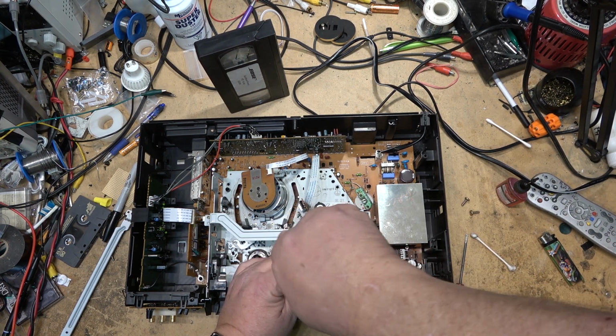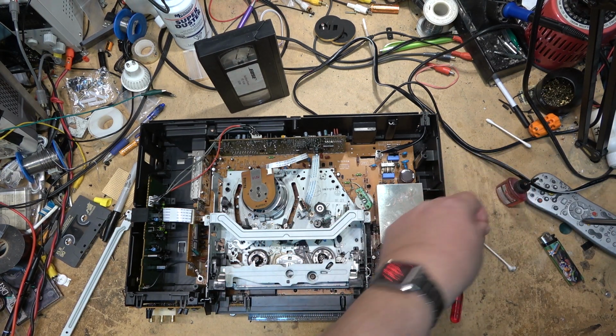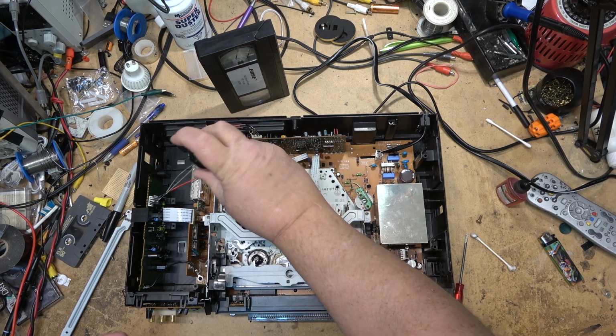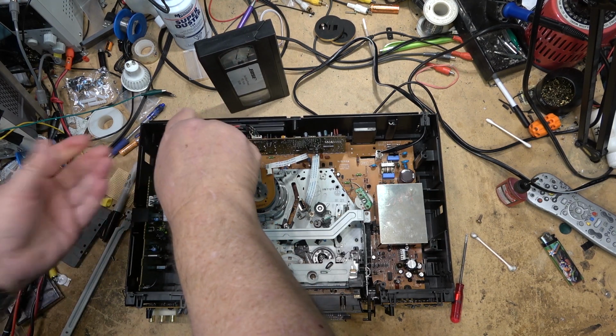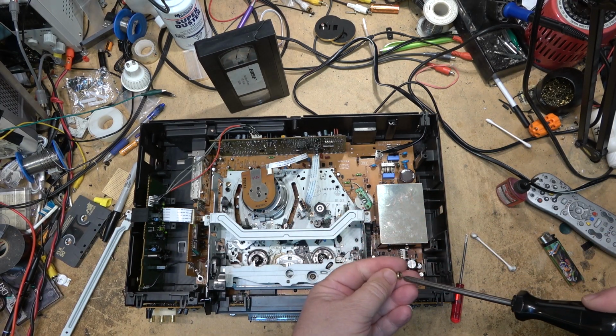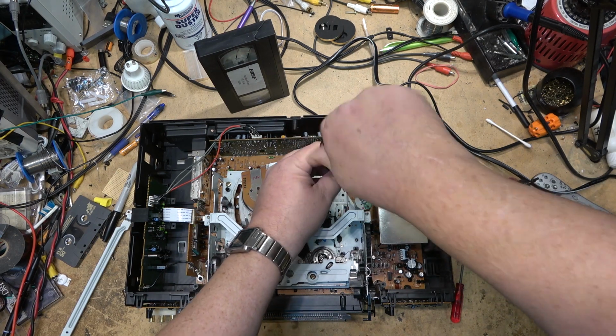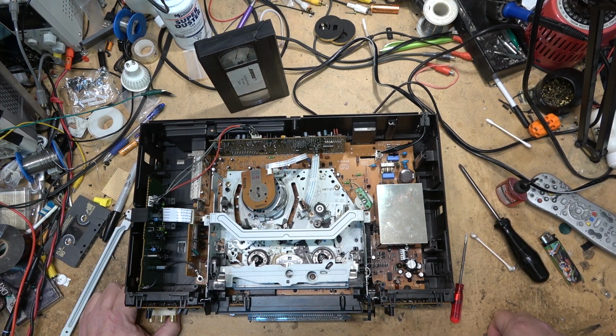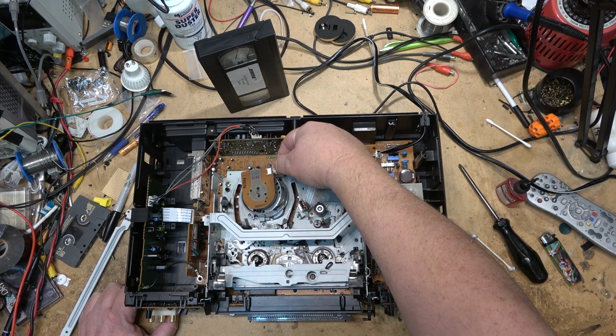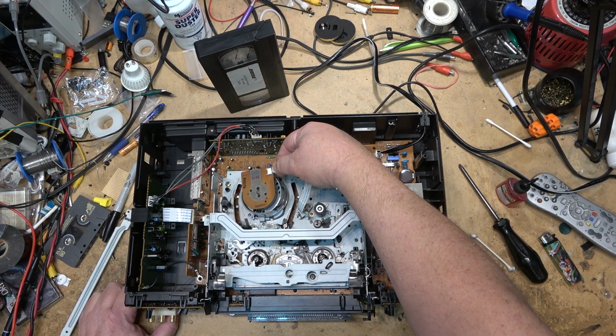And the best thing you can do to maintain a VCR, believe it or not, is use it. If you've got a VCR, even if you're not using your VCR on a regular basis, if you put a tape into it, maybe once a month, run it through all its paces. Play, fast forward, rewind, forward search, reverse search, eject. Even if you don't have a TV hooked up to it, just put a tape in, go through all the modes once or twice, and then shut it off. It'll keep moving parts lubricated. It'll keep that mode switch from getting too dirty, because the action of the switch contacts moving will keep it clean, and it'll increase the reliability of the machine so that when you do need it, it's going to work.